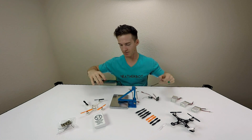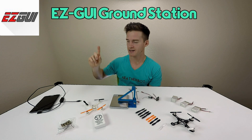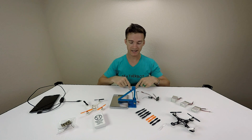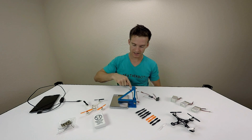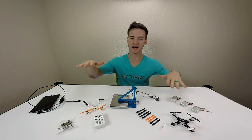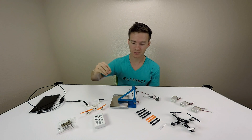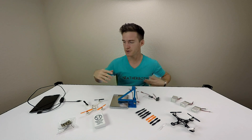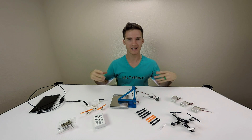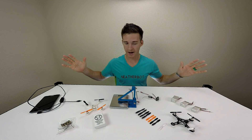There's an app on my phone - I'll put the link below - that works on Android (not sure about Apple). It lets you go in just like Betaflight on a PC and isolate a single motor. I've got motor 2 hooked up right here and I can just drag a slider to give it max power. There's no flight controller trying to cut back power because you're not level - it just straight up gives full power for as long as you want. This is the best, most consistent way to do it, and I'd recommend you follow this procedure if you're trying to do this yourself.